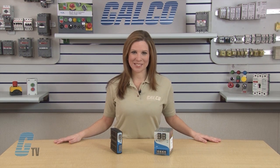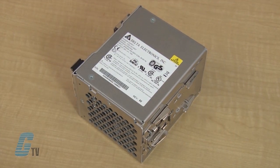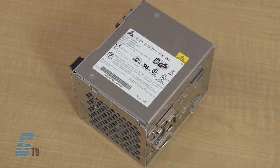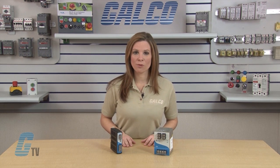The power supply provides over-voltage, overload, and thermal protection. The overload protection prevents damage resulting from over-current. When the rated current is higher than 150 percent, the output voltage will start to drop automatically. When the power exceeds the maximum limit and reaches UVLO, the under-voltage point, the power supply will enter the bouncing mode. Once the overload is eliminated, the output voltage will return to its normal level.